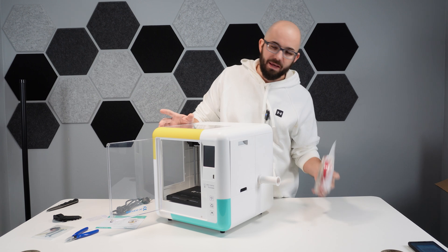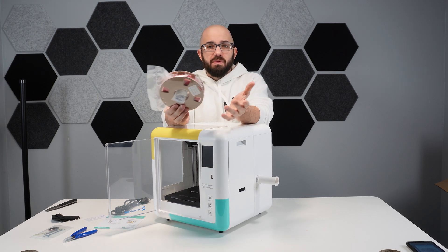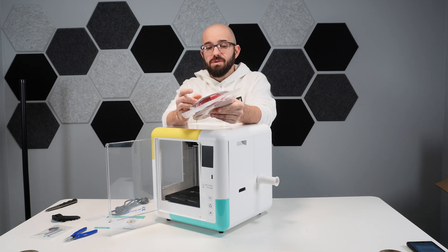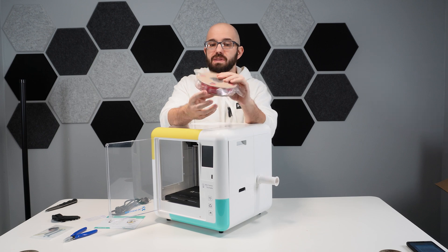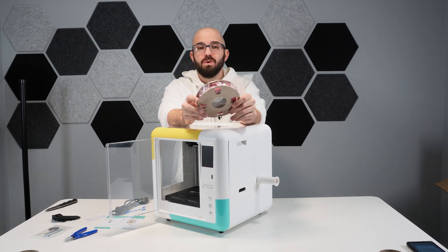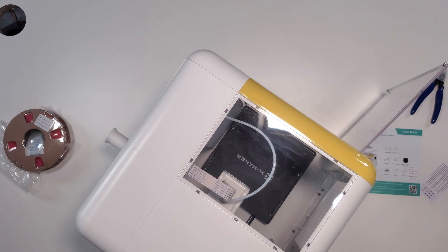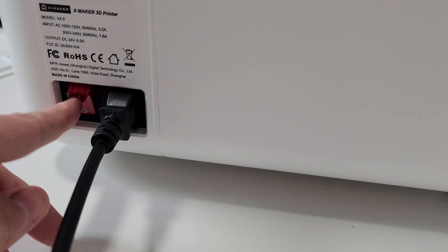Something to keep in mind with filament — a random side mention for those who are new to it. The filament is made of different types of plastic; this one specifically is PLA, and plastic can take in moisture. That is why these come vacuum sealed. If you buy a bunch of colors and don't know how long before you use them, it's best to store the spools inside some kind of container and throw the included silica gel packet in there to absorb moisture — it'll make them last a lot longer. Older rolls that do absorb moisture will still work, but it can really affect print quality, cause bubbling, and cause layers not to stick together. And then of course we have the power cable — a pretty standard three-prong PC power cable.